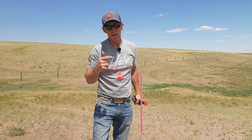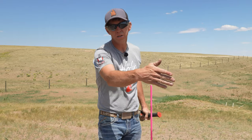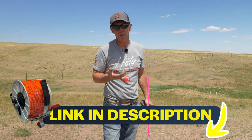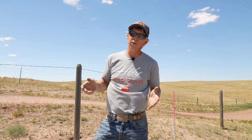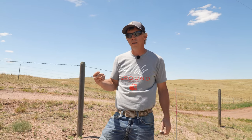This is not a placeholder for the post — this is just establishing the line. After these are in a straight line pointed end to end, we can either do a tensioned wire across here or we could do a string line and sight everything in using these to sight off of. If there are trees in your way, this probably isn't going to work and you're better off calling a surveyor to get you midpoints in that fence line. You could do this over multiple hills as well, but that gets more complex — it'll take more time and you'll probably want a second set of hands and maybe a walkie-talkie.